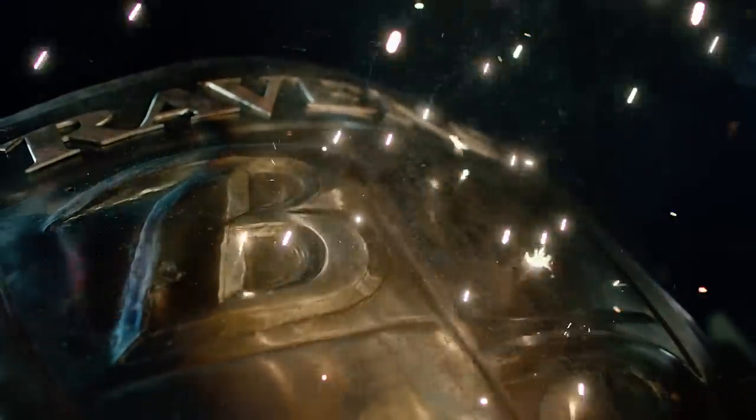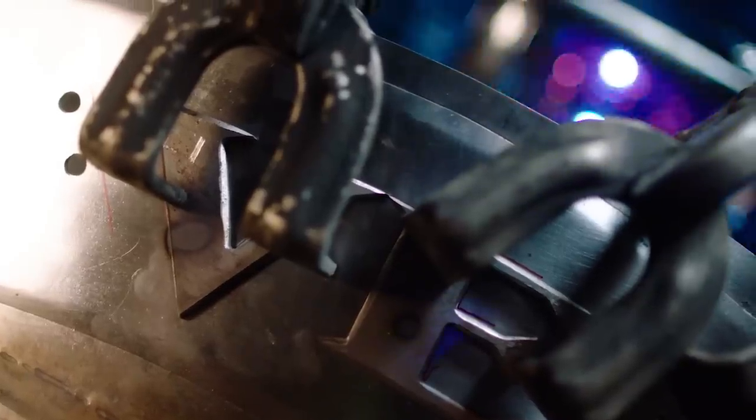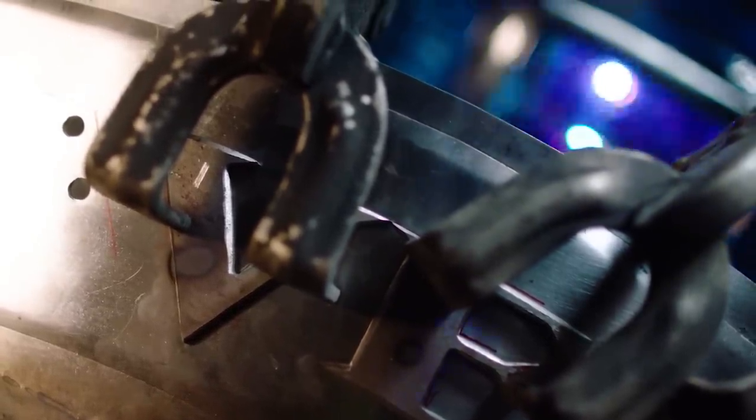Because of the way we chose to make the shield, it's actually not all that heavy. It's very light. And since we repoussed the details in it, it gave it a lot of strength, and then we heat treated it. So it actually kept the weight down a bit, but it's still very tough, very durable. The physical properties of the shield, the size, the weight, the thickness of the material, are pretty identical to the ones that would have been used when made out of steel on a medieval battlefield. The shield is very resistant to hits, smashes, and cuts.